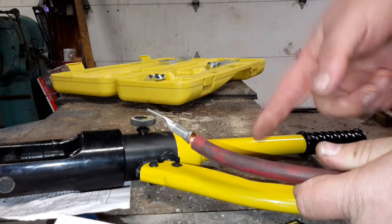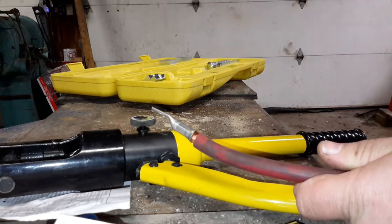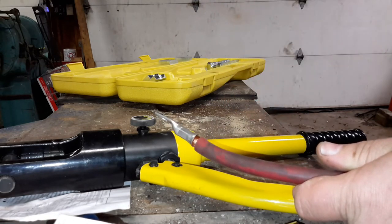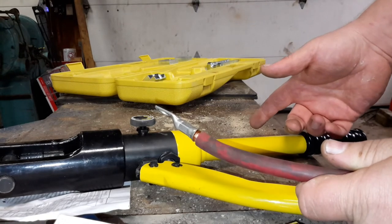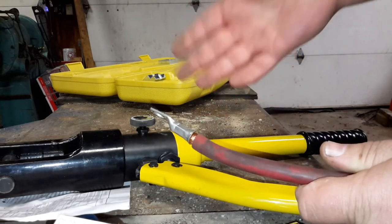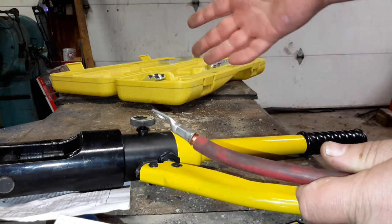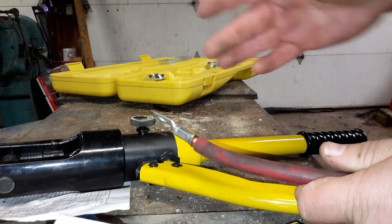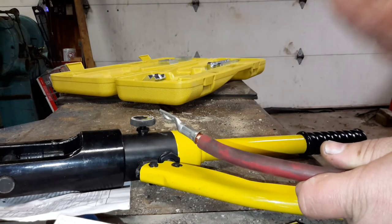And for those of you that say, Fuzzy, why don't you solder? Well, on my last lowrider, it was another Lincoln, it was a '91, and I was doing something, hopping it. I was pretty much abusing the system, the hydraulic system. And stuff back there got so hot on one of the motors that it melted the solder and the cable fell out. So ever since then, I'm not a solder guy. Crimp guy. Every car in the world that has connectors from the factory, they're crimp. I shouldn't say every car in the world. Somebody's going to be like, Fuzzy, you dumb piece of shit. Most cars out there, they're crimped from the factory, not soldered. If it's good enough for the billions and billions and billions of connections that have been made already, it's good enough for me.